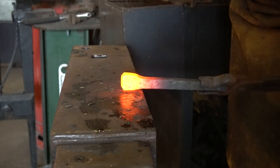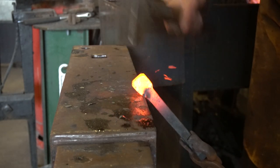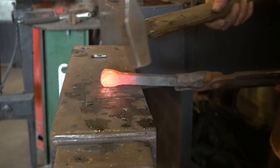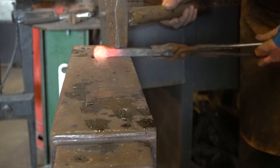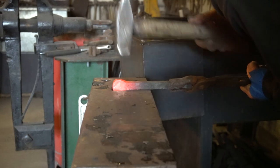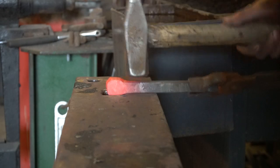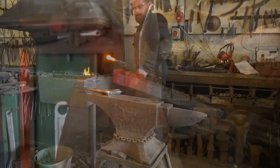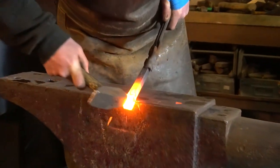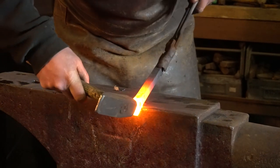Square that up a little bit more because I've got a bit of a balloon shape and I want this to be an octagon. I'm going to tidy up these shoulders here — I'm going to take it over to my hardy hole and just do that with a hammer. And the same on the other side. So nice and hot again, I'm just going to repeat that process. I'm going to do it on the far side of the anvil this time, simply because I can then square up the end as well as working on these other faces.